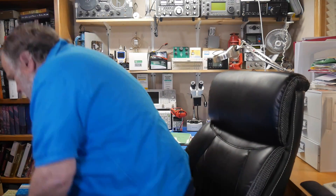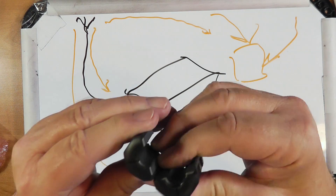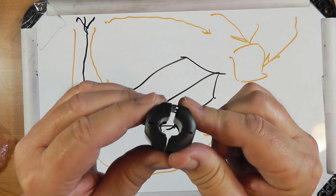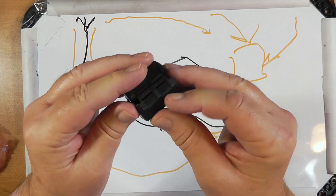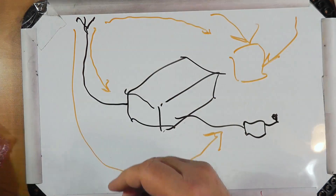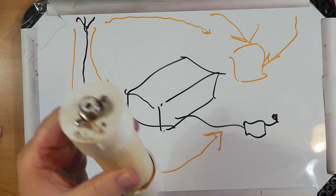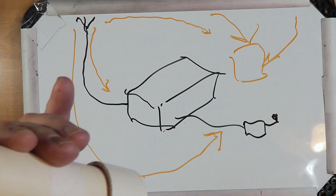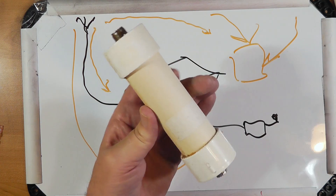You get these kinds of things on Amazon. It's got a space for a cable to go in there, and then this comes around like this and snaps shut. This is big enough that you can actually run the cable a couple of times through it before you snap it shut. This will help remove the RFI from the cable. Here's another thing you can do — this is an MFJ product. It's a piece of coax between here wrapped with like 30 beads. It's been outside, so it's a bit dirty.